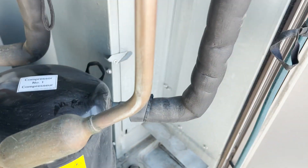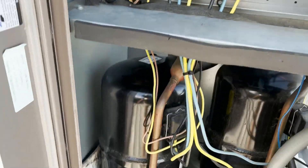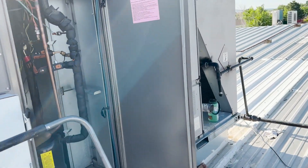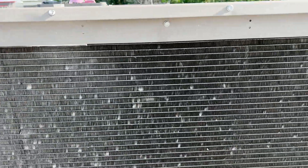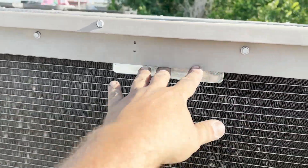There's a lot of water coming out of there. We're back to life. This is the circuit that was down — we're just watching it come on. There's our second circuit. We've got two stages back on this compressor. The coils are nice and clean, and the repair is underneath this patch so the air doesn't get cold through it.